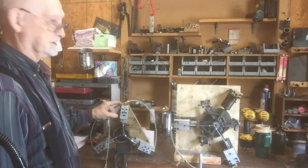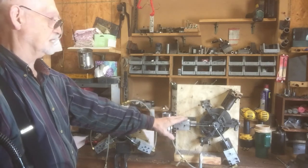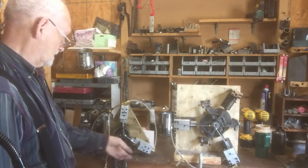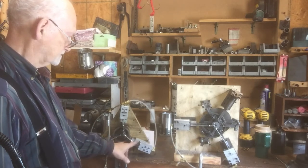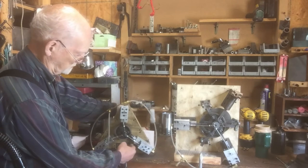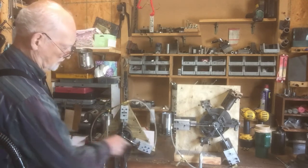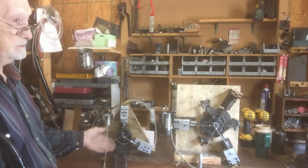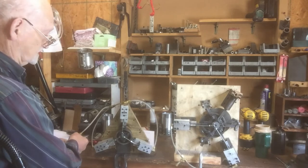This one is the first one that I was able to create a valve that didn't leak. Once I did that, it gave me the opportunity to come back and use this engine. It works really, really well, although I had to come up with what they call a flexible valve stem, because the cylinders rotate so they have to bend in order to still work in the proper orientation.